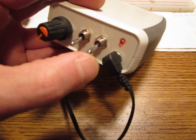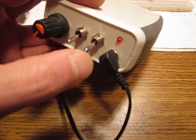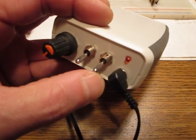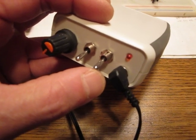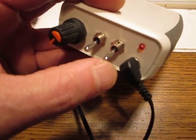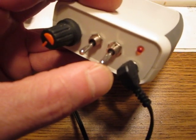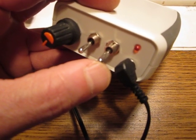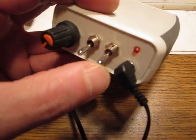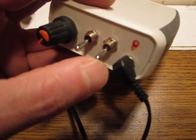And the second switch is shorting the capacitor, so basically it is disabling the 555 oscillator and is not triggering the double oscillator built on a 556. So we have just two waves coming out going to the modulating transformer, 111 Hertz and 1110 Hertz.